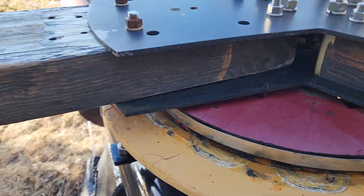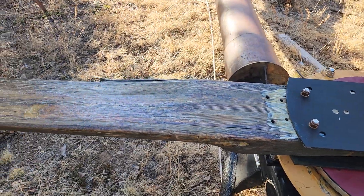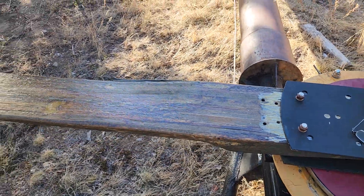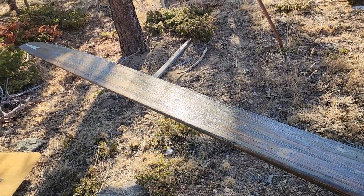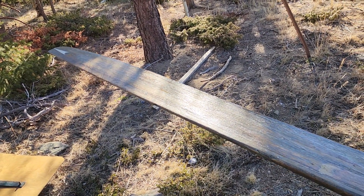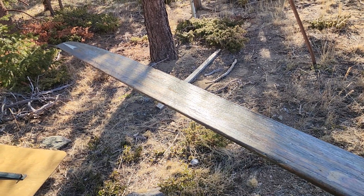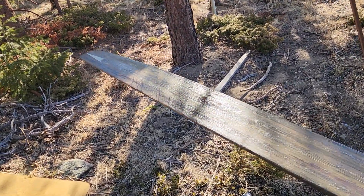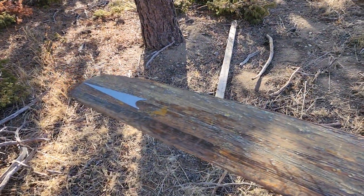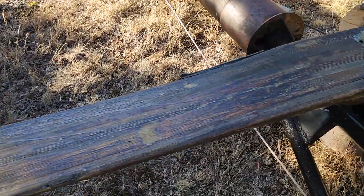It's a 20-foot turbine. The original blades I made were much wider than these. These blades actually work really well, although it runs a little bit in stall in higher winds. These are old blades off a Jacobs turbine — I think they used to be 24-foot diameter and we cut them down. I'd have cut them a little bit differently had I been doing this today. But these are old Sitka spruce blades.